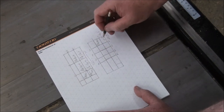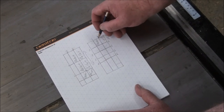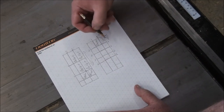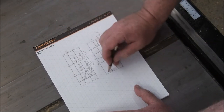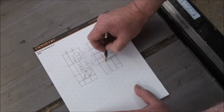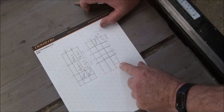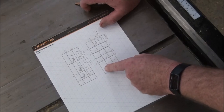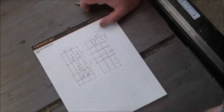So similarly here, I get my 4 covers down here. That's what we did with the track saw. Cut number 1, we ripped these right down there. And then I put them on my radial arm saw and I cross cut each one of these this way. Okay. Then I actually took this piece here, which was too narrow for a cover, and I cross cut it as well at the length for covers. I was left with a piece at the bottom that was either wide enough for a cover and not long enough in these 2 cases, or not long enough and not wide enough. So that was a bit of a challenge for that piece, but usable.